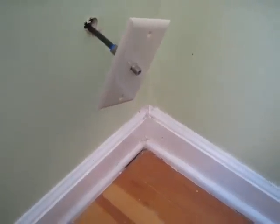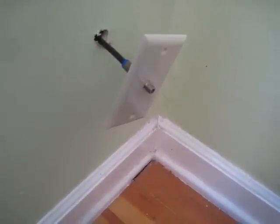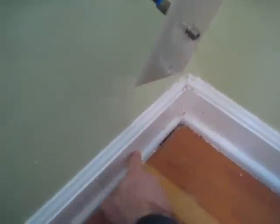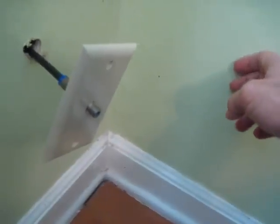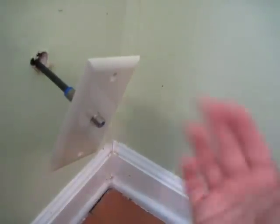One of the hardest things about fishing a wire through an existing wall is knowing exactly where to drill, where to start fishing it. Now underneath here is a crawl space, and it provides pretty easy access to this wall — we really only have to go up a foot. We have to know where to drill into the sill so we can go straight up. If we're a little off, we'll probably wind up past the next stud and we're in the wrong place. You have to be a little creative. There are some existing receptacles that come up from the basement, which helps.